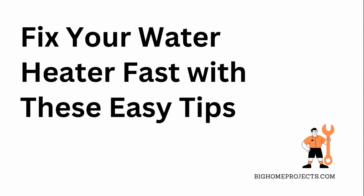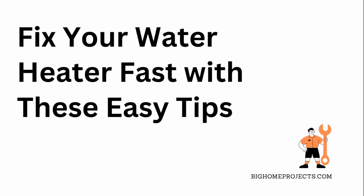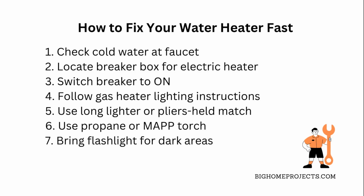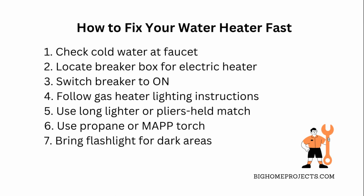If your water heater is acting up, the first step is making sure cold water is actually reaching the unit. Sounds simple, but you'd be surprised how often people miss this. So, here's the deal. Go to any hot water faucet in your house and turn it on for about a minute. If water flows steadily, you're good on the cold water supply.